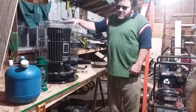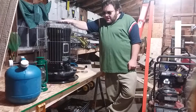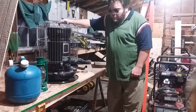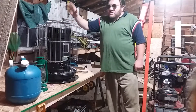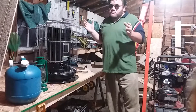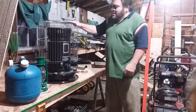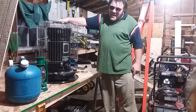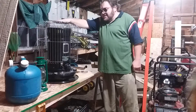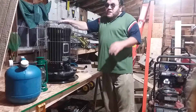You still want to use these in a well-ventilated room. I would not recommend using these in a small confined space unless you have pretty good ventilation. The reason they recommend K1 kerosene is that K1 is an odorless kerosene, and that's what you want to use.